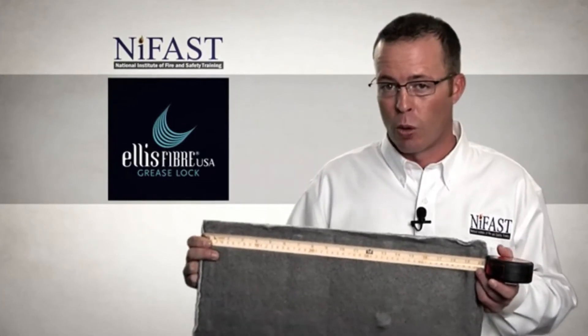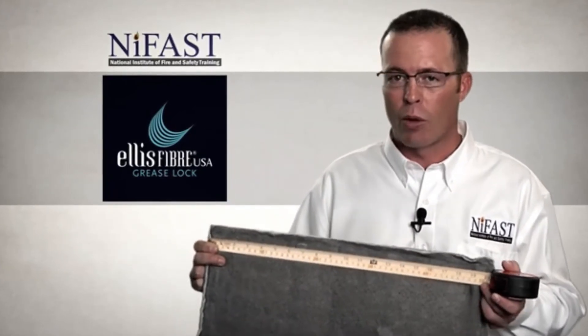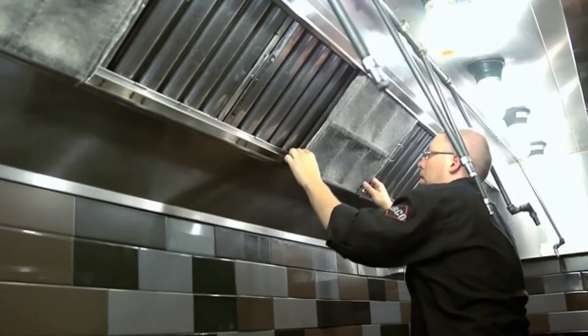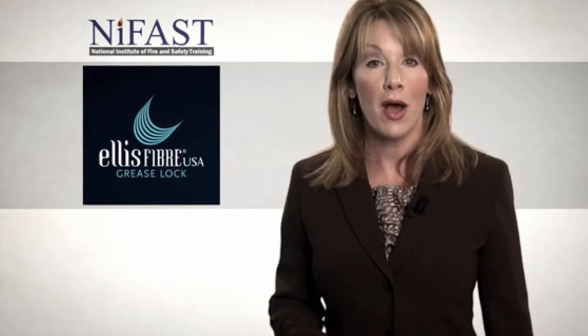All GLS filters are 20 inches wide, though they vary in height. A clean grease lock filter can be installed without regard to the front or the back, but it must be installed to carefully conform with the 20 inch width. An important note: never reverse the filter after it has been installed and used to collect grease, because reversing the filter's direction will pull the grease from the filter and deposit it into the kitchen exhaust system.